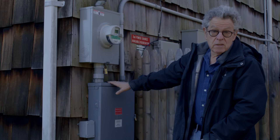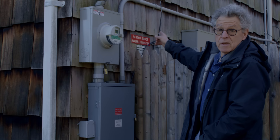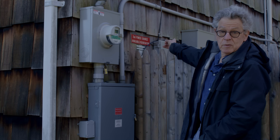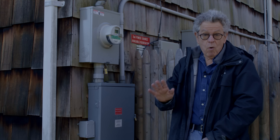Then it goes into an outside main box. The main box used to be inside; now it's outside because I split it off. One side goes into my home and powers all the dirty stuff, and one side goes around the side of the house into a sub-box outside my listening room that powers my audio system. The entire ground system was reconfigured — that was creating all kinds of hum issues for 20 years. I should have done this a long time ago.